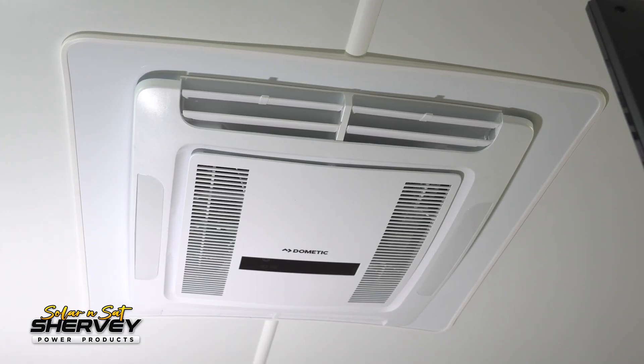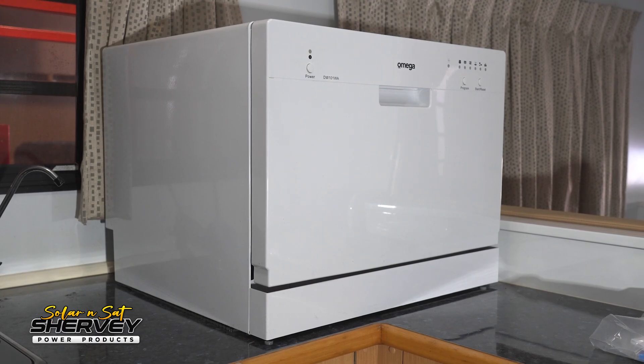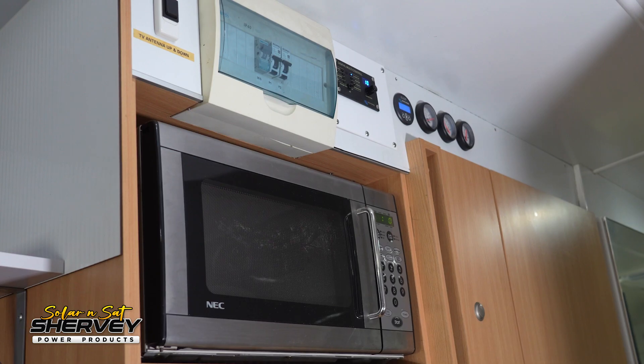So the customer's usable amount of power is actually over 5,000 watts because it's mains plus what the inverter is capable of — it's a Victron-specific feature and it's really cool. Especially with these bigger trucks running aircon — they want to run aircon and still have all their other appliances as well. We can provide that power boost so they can run the aircon plus have their coffee machine or microwave going at the same time. This customer can just turn it all on and not have to think about any of it.